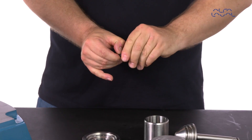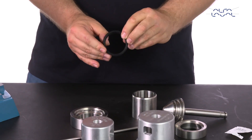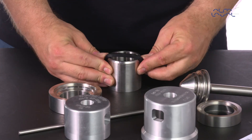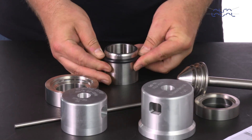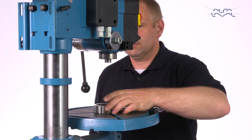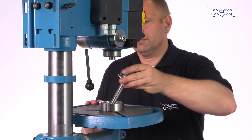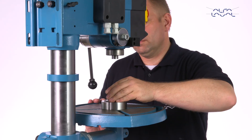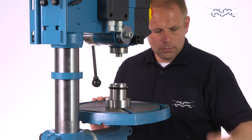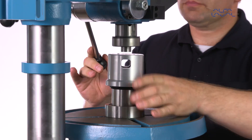Please follow all of the steps outlined in the instruction manual. Place the plug tool housing on the drill column or in a hydraulic press, insert the plug into the tool and place the large inner guide ring on the plug. Then place the large outer guide ring onto the inner guide ring and press it firmly into place.